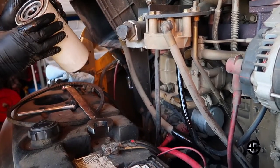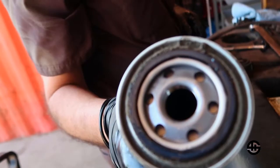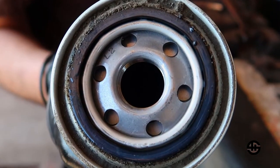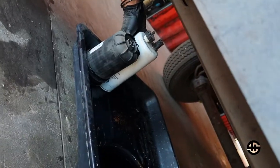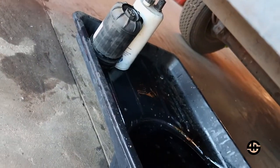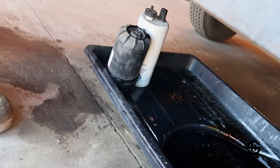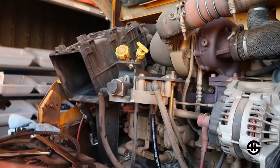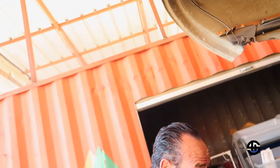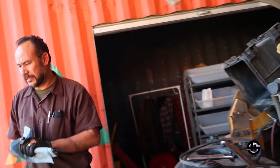That's not good. This one's empty. And typically when there's an empty filter like this, there's an issue with the fuel system. That could be a problem coming. Got fuel coming out of it right now though. Yeah, but it's only like a quart full. It needs to be topped to the top, dude. Okay? So, let's start putting filters on.